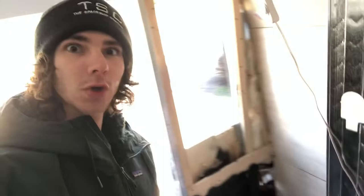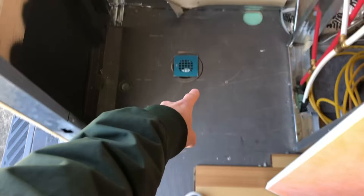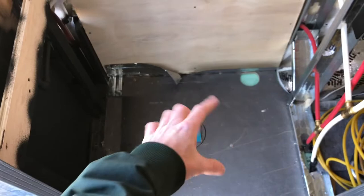Good morning on this super chilly Georgia day. Before I get too far ahead of myself, I wanted to show you guys what I was doing in my shower. I got this Schluter KERDI-BOARD shower pan, waterproof membrane, and I'm going to put that as my floor instead of this van floor. So I'm going to cut this out — I already started the process. I peeled back these steel studs and tried cutting them out. I'm going to take this off-centered hole, cut this out and use that as a template, put it on this and cut this out to fit this space.